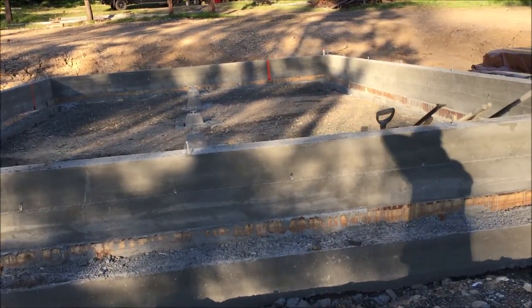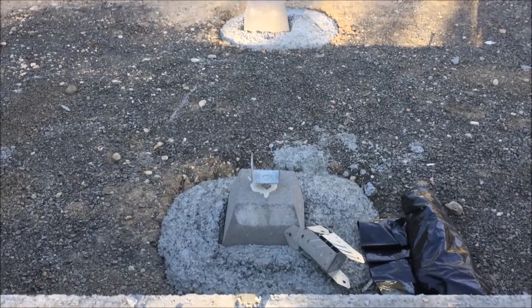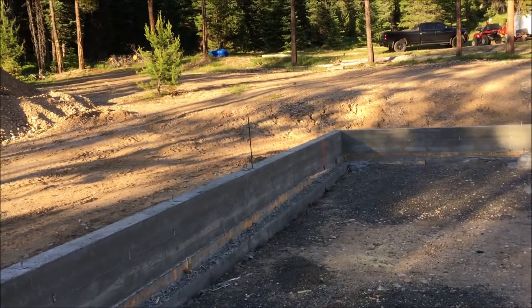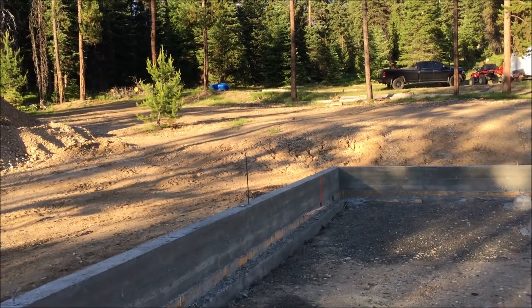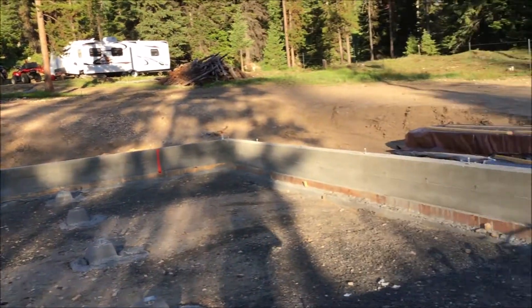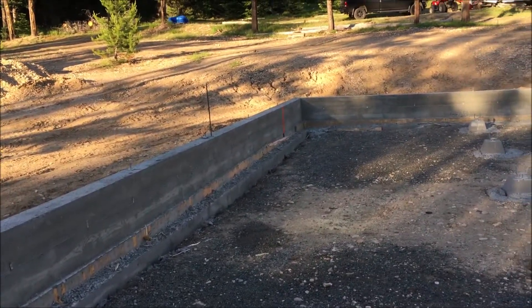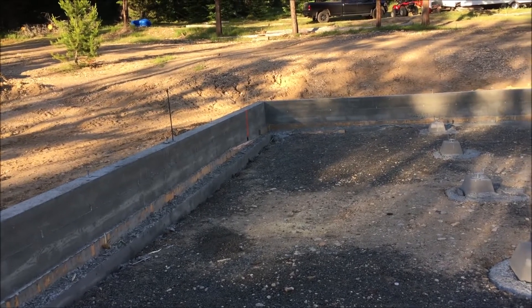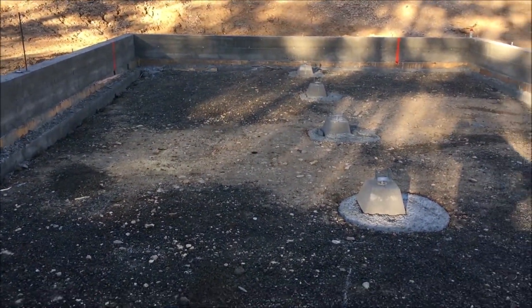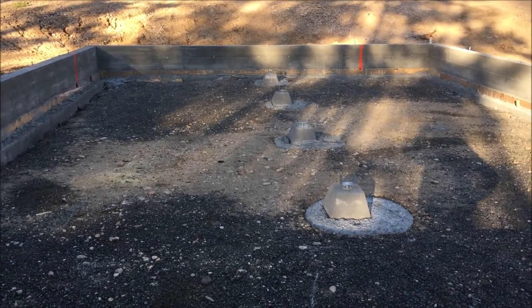You can see down the middle is where I wet-set my pillars that are going to be the supports down through the middle of the support beam and the subfloor. There's also a 20-foot continuous rebar coming up out of the footers for the electrical inspector. I'll fill this up with gravel next, and I'm going to put 2-inch styrofoam insulation around the edges.